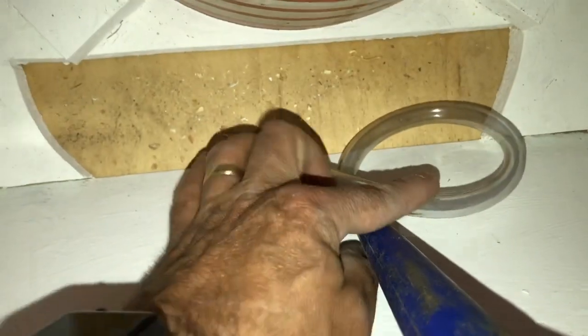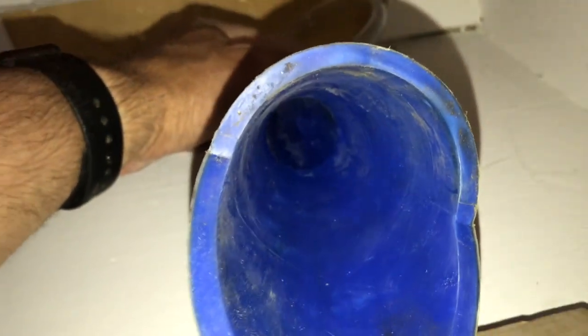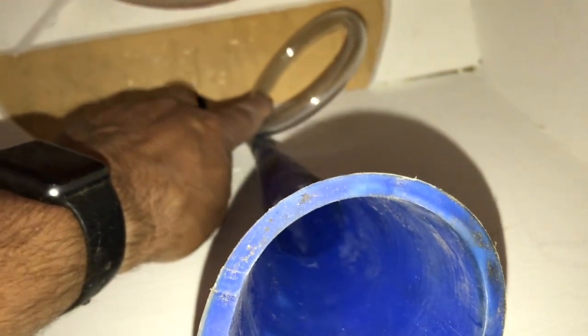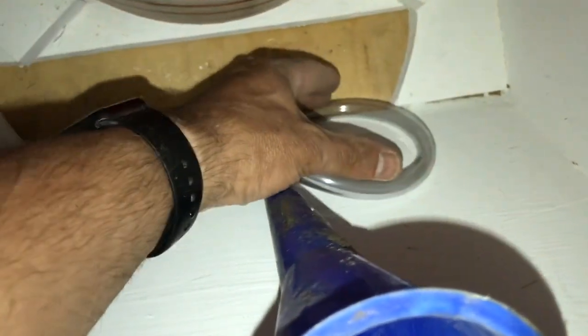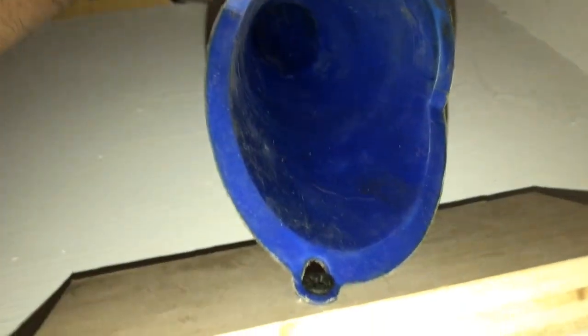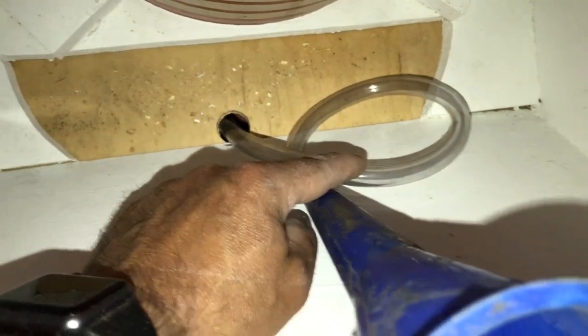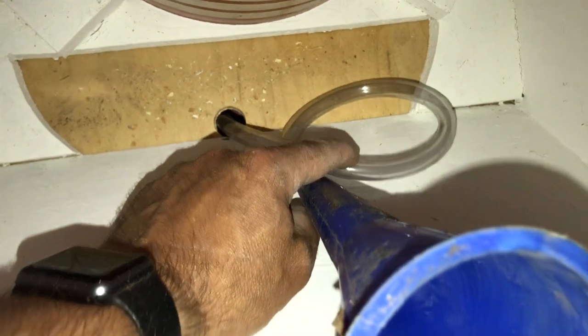Here's the funnel. This, when it goes down, will land and just sit just inside this funnel, and then the urine will go down through here obviously through this tube. I'm going to put this pigtail in it to create a little trap, and then the rest of it will go down through there. Each time we use this we're going to have a little squirt bottle with water and vinegar to just rinse it down, and that will put more of that into this little pigtail so it's not just urine that's trapped in there. Hopefully that'll work, and if we run into any trouble down the road we'll make some modifications. This will be clamped against the front, clamped in place so it doesn't move, and of course I'm going to put a washer on that to hold it in place. Then it's going to go down through and I'll show you in a minute where it's going to come out and go down through the bus floor to the greywater tank.